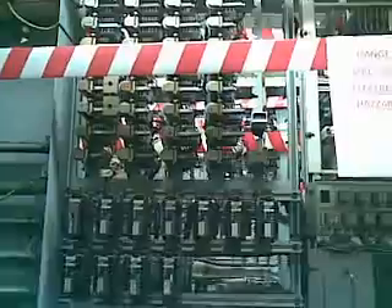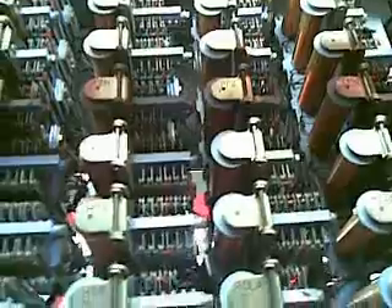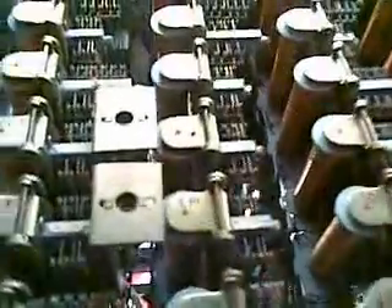You can listen to it all going clickety-clack. These relays are very similar to what Express used to make — no bakelite bow or pushrod separators. They're made out of plastic. Sometimes if you would get a short circuit, what would happen is it would back-feed, there's a contact, and then sometimes it would melt the separator. And then you'd have to pull the relay apart and repair it. But a good lift in their day, and very rare to find.